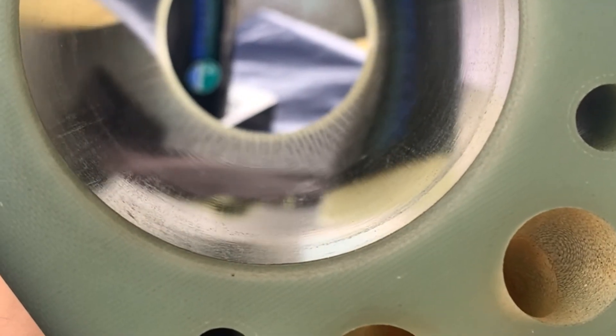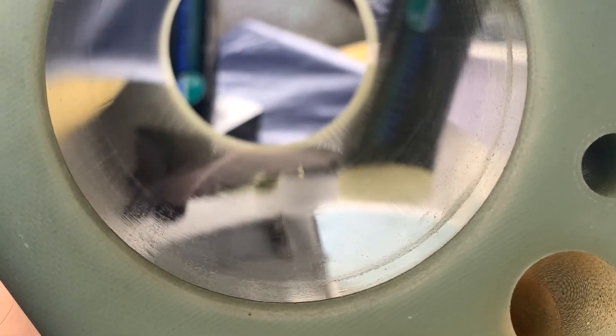I don't have a new cylinder and I don't want to risk ruining it with a honing tool, so what I'm going to do is just clean it and replace the piston, and hope that this will fix the problem. This cylinder — the piston was seized and it didn't move. This is why I suspect the pump was asymmetric and it was returning half the production of fresh water.